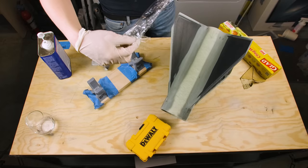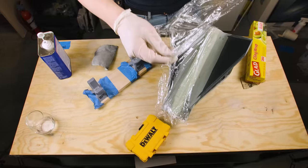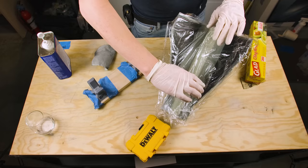When we do surface preparation, we want to do it as close as possible to the actual epoxying — we're removing the oxide layer, which slowly comes back over time, and dust or lint could get on the surface and compromise the bond. Between surface preparation and epoxy application, I tried to keep that no more than 15 to 30 minutes apart, and I covered the fin can with saran wrap in between so no dust could get on top.